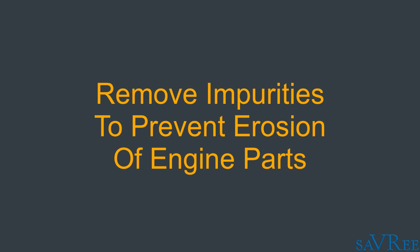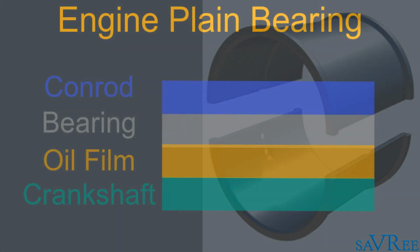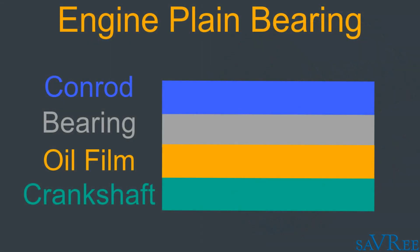Now, if we didn't remove these sandy particles, these foreign bodies, then they're going to go straight to our bearings and other machinery components, and these components usually operate on very fine tolerances. Remember, a plain bearing has an oil film, and these bearings are also called thin film bearings. They're referring to the very thin layer of oil that separates the bearing from the pieces it's sandwiched between. So let's imagine that the bearing is sitting between the crankshaft and the conrod.